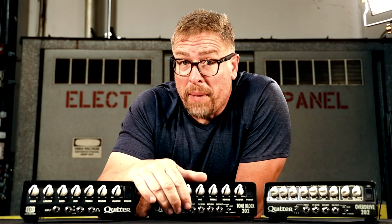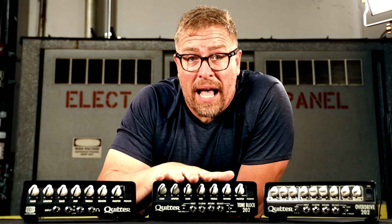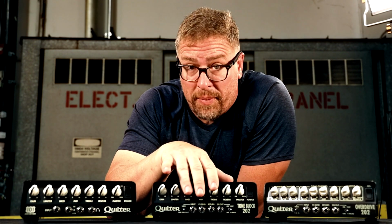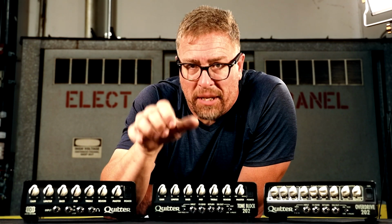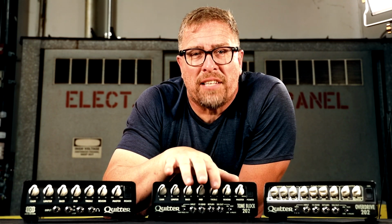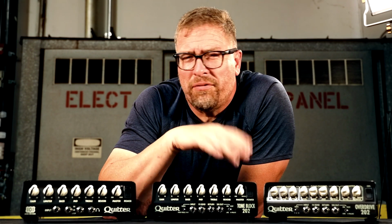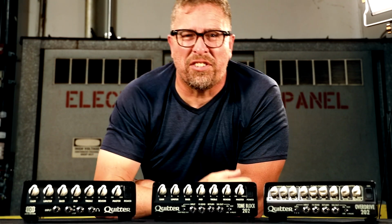If you flip that switch to the middle, boom, output impedance shoots high, we got that low damping factor, and we have an amplifier that then sounds like a magical tube amp. In full Q, the big difference is that bass, mid, and treb are all active, boost and cut. If we flip that over to vintage, we have a typical Fender traditional tone stack. In the Fender tone stack, that means the bass and treble EQs are passive. The mid remains active because if you ever played on an old Fender, that mid knob never worked anyway, so we figured let's just make it work right.